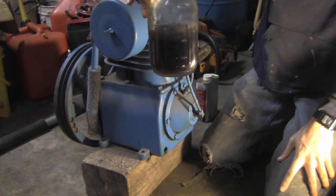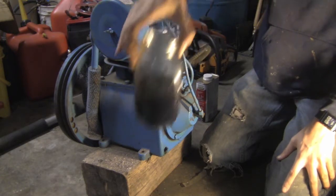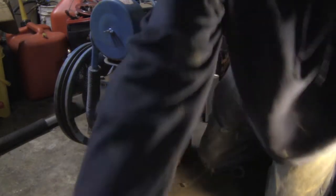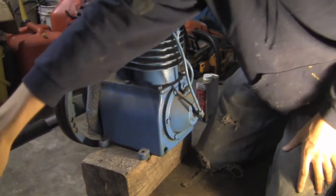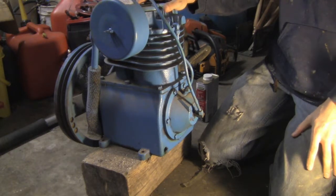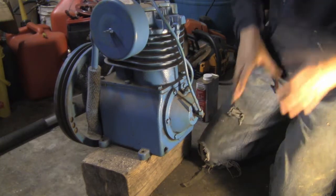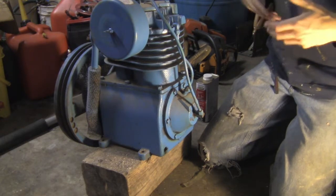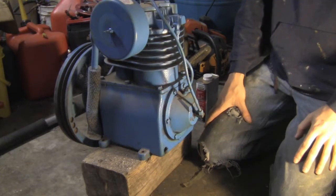I intended to flush the crankcase a little with some acetone, just to get any goo out that's in there. What came out — the acetone sits on top of instead of mixing with it, and it just looks like it's about 80 weight gear oil. So probably what I'm going to do, rather than use this really nice synthetic compressor oil by Royal Purple, is put some ATF in here. I know somebody's probably going to say ATF will ruin the thing, but I'm not going to run it like that for long — maybe 30 minutes or so — just let the thing run, stir everything up, flush it out, then put some cheap compressor oil and run it a bit longer to flush out any garbage and free up anything that may have gotten gummed up by that really nasty oil.